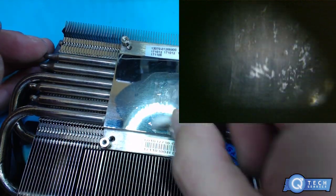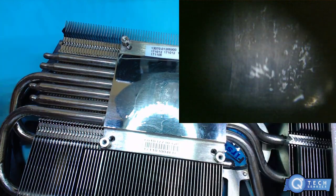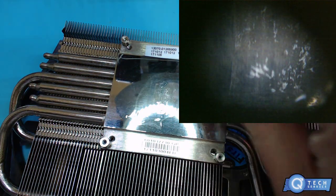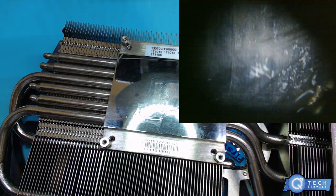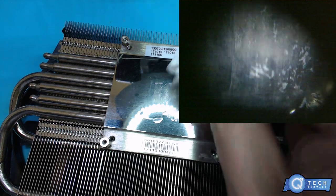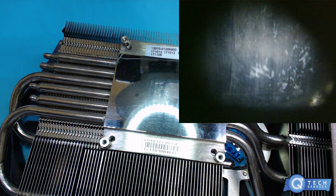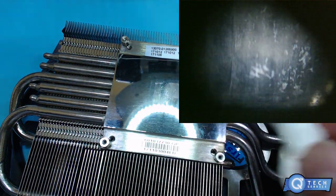Well, I know if you have thermal paste, you'll usually see it eat into the heat sink sometimes, even just a little bit. You took Xboxes apart back in the day, 360s. I would think that's just really hot. No, but I see them too on the PlayStation 4s, the die packets, and the Xbox One S's. It'll wear it out just like this, in a sense, but not this bad. It's kind of like etching it inside there.